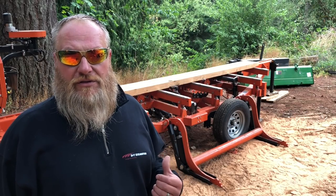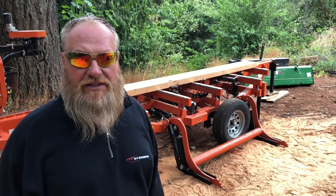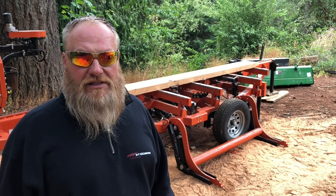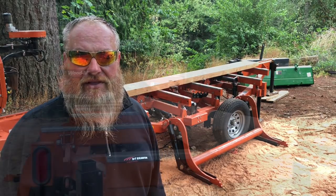Now, out of this 12-inch slab that's left, I'm going to cut two countertops that are going to go onto this front desk. One is going to be 6 feet wide, and the other will be 3 feet wide, and they'll both be an inch and a half thick.